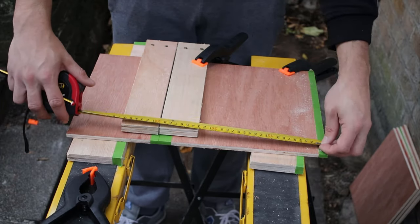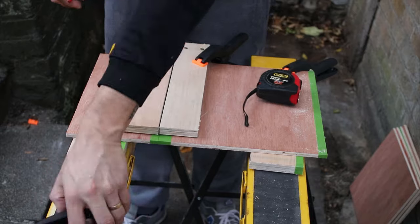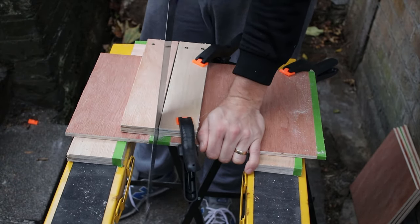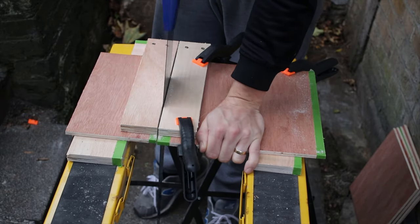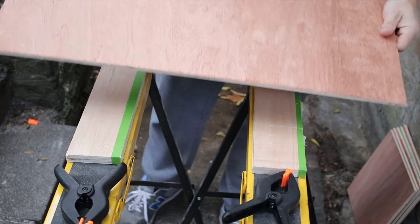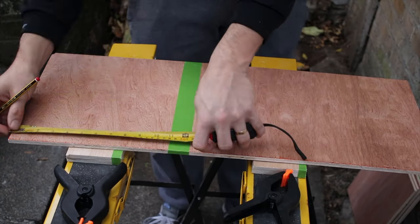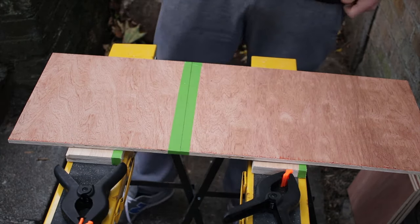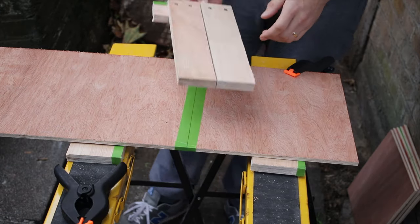Another tip: if you don't have a circular saw, simply use a hand saw and this easily made jig. All you need is two pieces of wood. You choose the length but make sure each of them has at least one original straight edge. Then with the help of a third small piece, place them close to each other so that only your hand saw blade can fit. Make sure they are parallel to each other. Now you can make a straight cut with your hand saw. I use this method to show you that it is easily done without any circular saw.